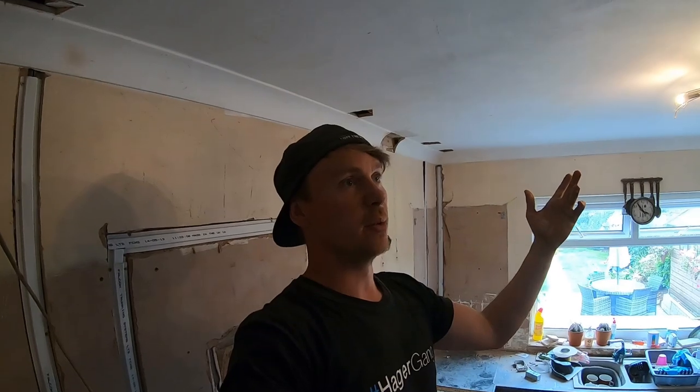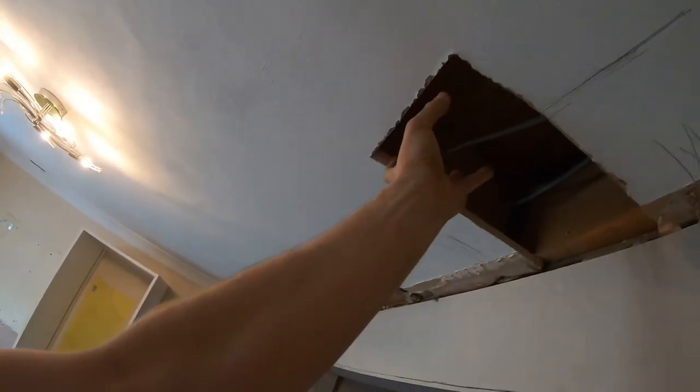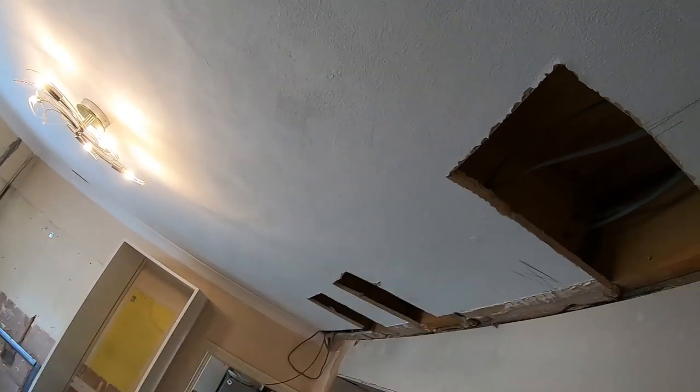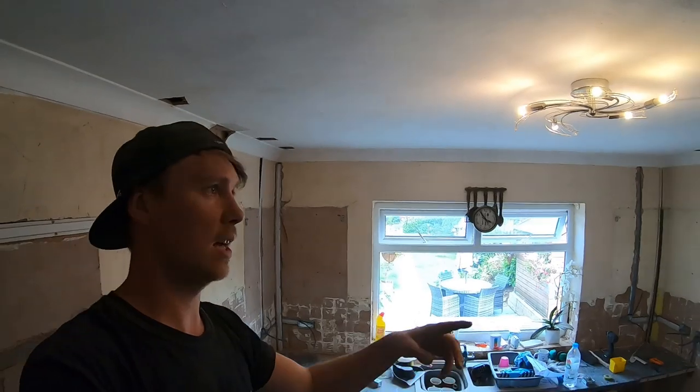So yeah, that's pretty much how you do it really, and then afterwards you get the plugs that you've cut out and then do your little batten across the seat. Like if that was the whole way around hole, you do a wooden batten across, screw to each one, and then put your plug back in, stick a screw in the plug, and you can put a bit of fill around that itself. So yeah, I'm gonna mark all these out, get them cut and whatnot.